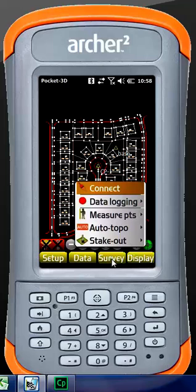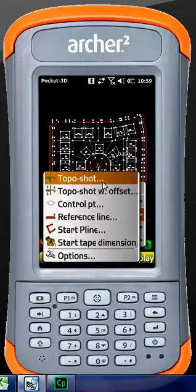Once we get into survey, that's where we do all of our work. Once your base is already set up, you go to survey connect, then choose what you want to do. Measure points — doing topo shots — is predominantly the most common use in Pocket 3D. You can also measure a control point by setting up your rover rod with a bipod. You can also measure a polyline — for example, to measure the top of a pond, you start and as you walk around taking shots it creates a line around the top, then do the same for the bottom.